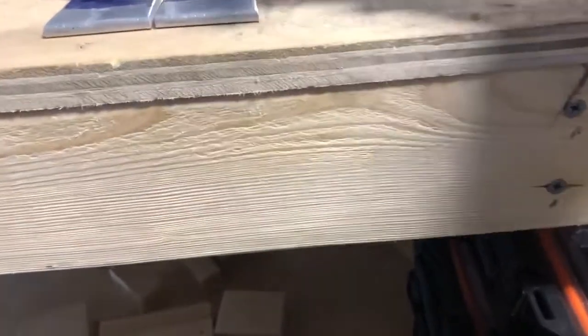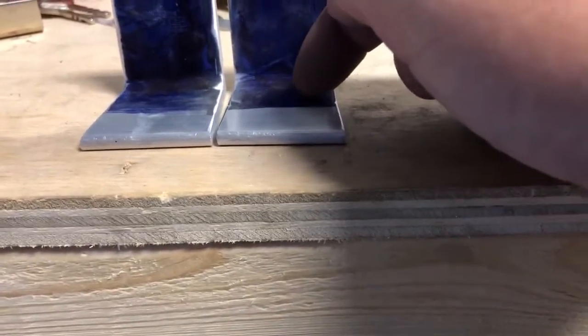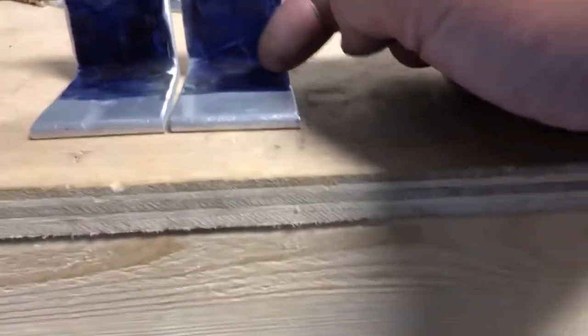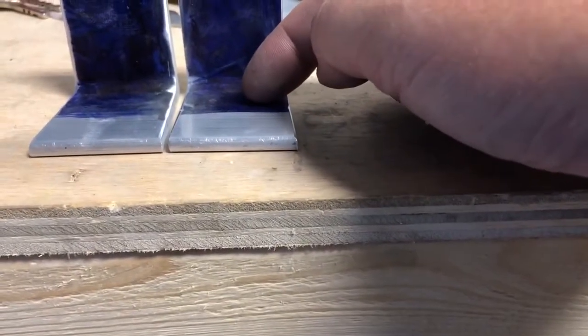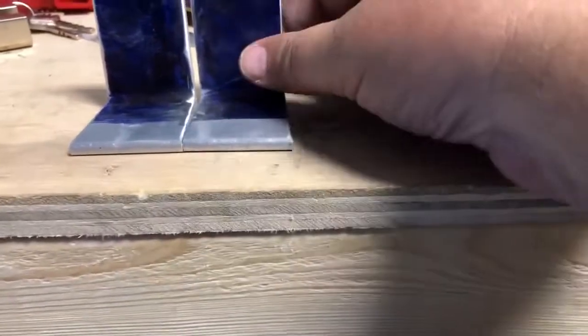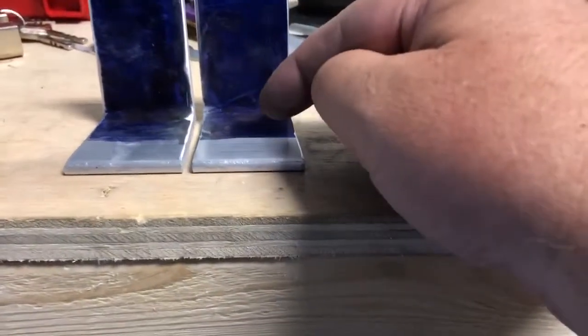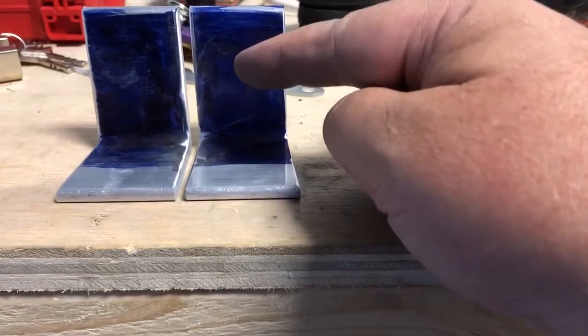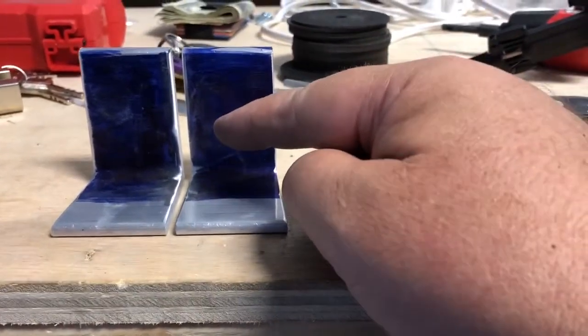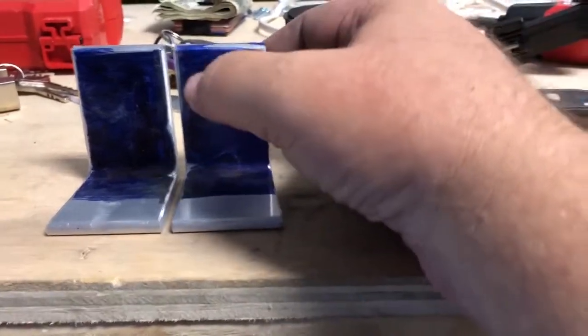So it's a little bit wider at the edge, because the whole purpose of doing this is to give yourself enough meat when you drill this bolt that goes in here and here, so that bolt hole, when drilled properly, is not too close to the edge. That's why they have you dog leg these out or flute these out, to give that bolt that sits on these far edges a little bit more material there. And that was the reason why I didn't like the ones that I did before, because these were good, but they were wavy. And the same thing with the rivet.